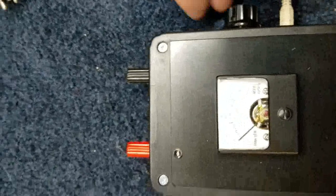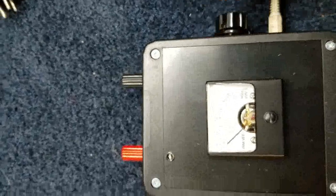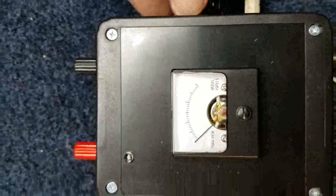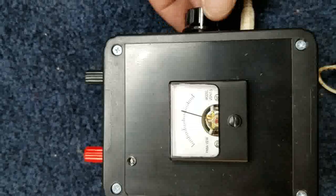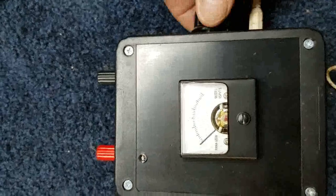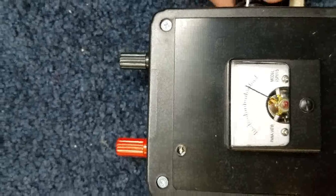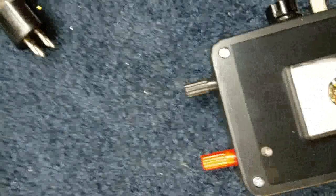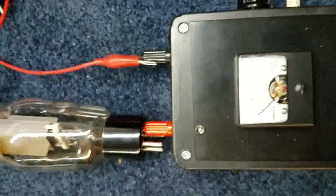The range can be changed by changing some resistors inside to get a different range, but this is suitable for the high voltage module inside. If I turn this up — there's five thousand volts, seventy-five hundred volts, ten thousand volts, twelve and a half thousand volts — that's probably enough. See, there's no arcs and the light doesn't light. I didn't turn it all the way up because it folds back if you go too high.